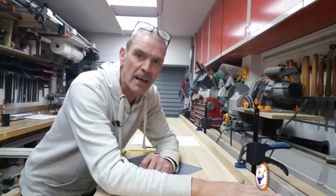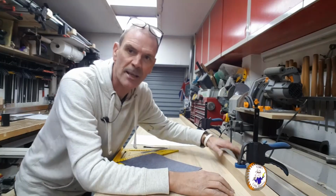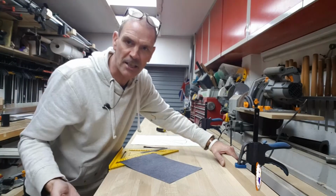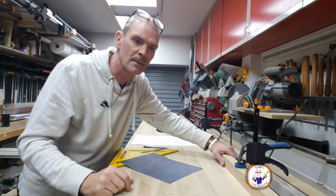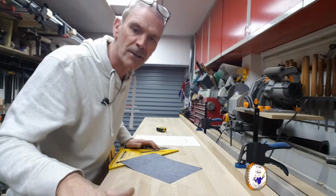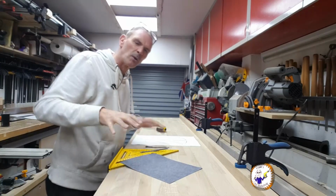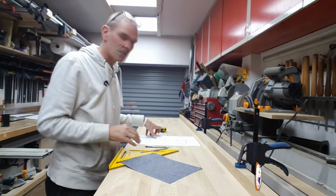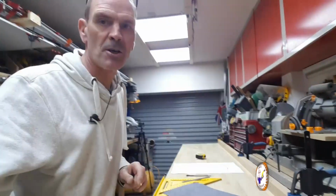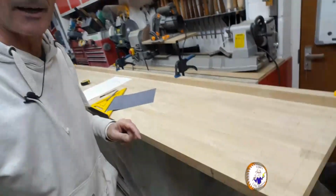One piece I'm using as the rear splashback. That will all be biscuit jointed. I've obviously cut another piece off the front. That's going to go underneath. You'll see that later. Now what I'm doing is I'm marking out where I want my channels to be for all the resin to go into, and also I've got the company logo which is going to go in the middle because obviously I want the corners to be rounded off.